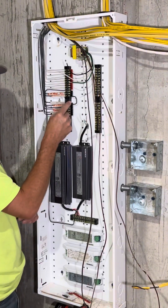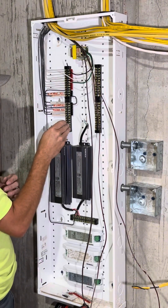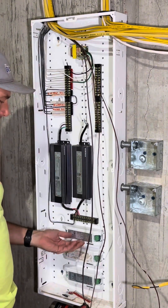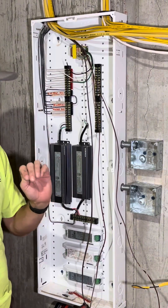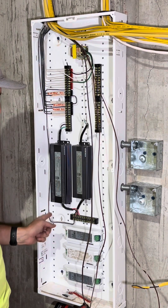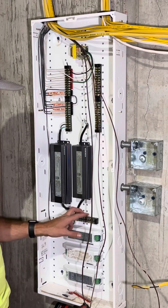My objective here is just continuity. Everything's hooked up on the load side — now I just need to hook the line side in and that driver is good to go. This driver and this driver are fed from one wire; that's a four-wire. One side of the wire is going to go to this driver, the other side is going to go to this one. So I'm going to loop this wire onto the line side of this terminal strip.